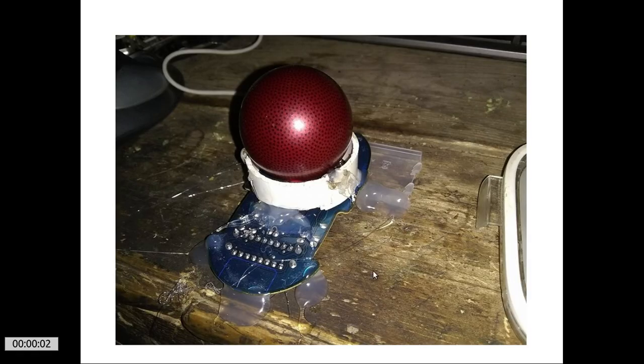So the next thing is, well, how am I going to custom make a suspension? And after more searching around on the internet, it seemed like silicon nitride balls worked. So I got some silicon nitride balls. You can barely see one there, and that's the ball out of my standard Logitech TrackMan trackball, and it glides really nice on those silicon nitride balls. So there's engineering test number 2: can I make a suspension for a trackball? I'd already proven myself I can do the joystick functions.